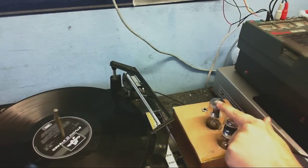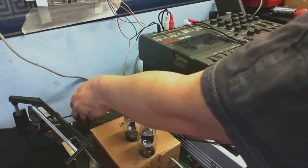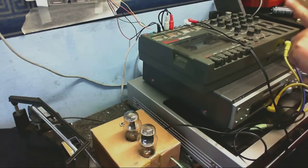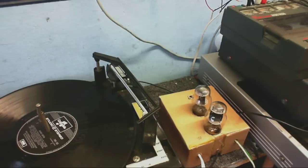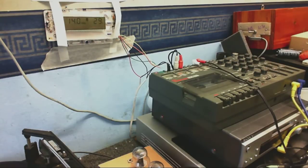Now, ignore this little thing here for now — that's not connected. What I've actually got here is the ceramic cartridge, the output from the ceramic cartridge from this salvaged BSR turntable. It's going along this wire and into this cassette deck. The problem with ceramic cartridges is that they are piezoelectric devices, so they have a very, very high output impedance. When connected to something like this, which has a relatively low input impedance — say, 25 kilo-ohms or something like that — the sound quality really suffers. It's all right for things like microphones and MP3 players, and that's typically what's happening with these Crosleys, although not to such an extent.